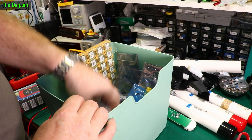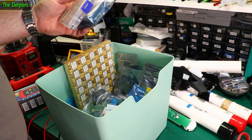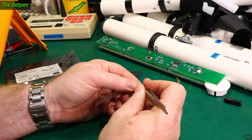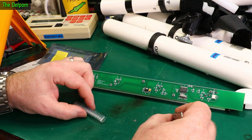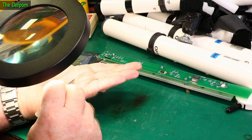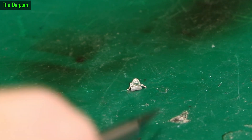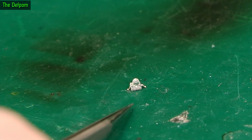After much digging around I managed to find some replacement LEDs. I've only got two lots, both 940 nanometers. I'm not sure those are exactly right — it could be 800 or 900nm — but these look very similar to the ones already on it. These are offset slightly to one side, which gives me the orientation. You can just about see it on camera — the dome part is on the right-hand side, which tells you the orientation of the part.